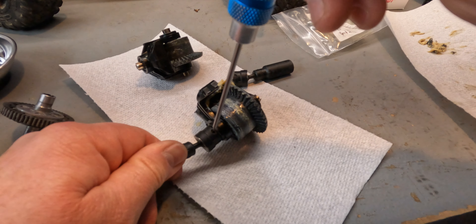That will technically be a parts one now. When you put this together, just make sure you align your set screw with the little divot on the spline shaft. Put that in — no Loctite or anything like that needed, just screw it in. Flip it around on the other side, do the same thing, locate that portion. Make sure you put on your invisible gloves. Tighten that one down — it's not cranking. Make sure I set this one enough. There we go — that's how fast and easy it was.